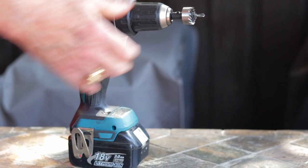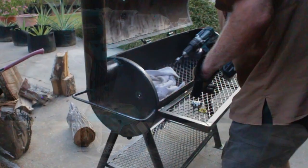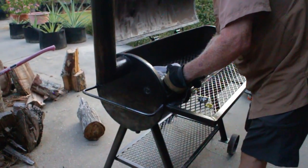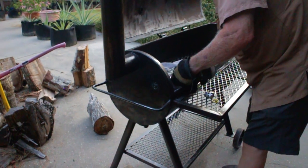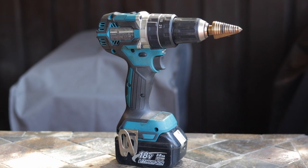You can mount it wherever you like, but considering that the firebox end is so much hotter, I chose to put it on the stack end of my smoker. Now mark the spot with the center punch. I used a 25 millimeter hole drill bit drilling through a quarter inch steel. The 25 millimeter hole was a little bit small, so I dressed it up with a step drill bit. In my case it had such a snug fit that I could have got by without using that locking nut, but I said I got it so I'm going to use it anyway. That's what it looks like.